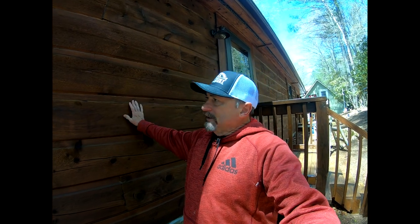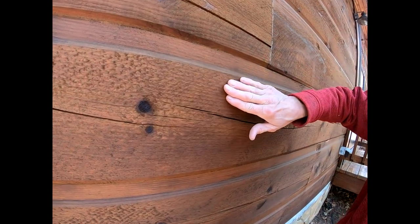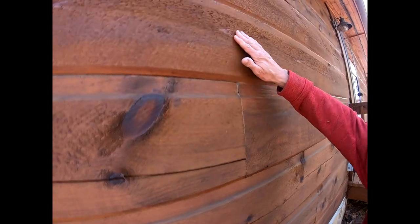This is a cabin that Mike and I are working on. It's stained and we just need to caulk up these checks. I'll carry you through a couple of different scenarios. This cabin's logs are very rough — you could get splinters — and for these flat rough logs and butt joints, the first thing we want to do is insert backer rod — B-A-C-K-E-R — into those checks. It's a closed-cell foam, meaning it does not absorb water.